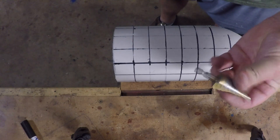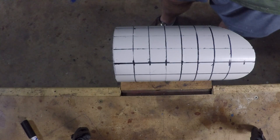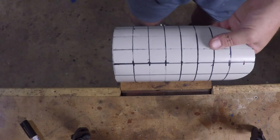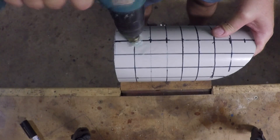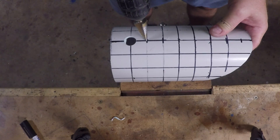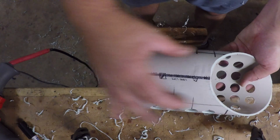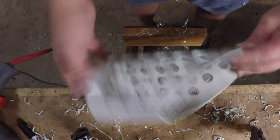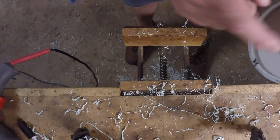The easiest way I found of doing these holes is using one of these step bits, and I make the holes 18 millimeters - just under three quarters of an inch. There's the holes done. I've not gone to that top row because I want to try and keep a bit of strength in the top for when we put the handle on. I don't go too close to the edge here because you're only scooping there and you do all your sieving back in that piece, so I'll do the holes in the back in a minute.